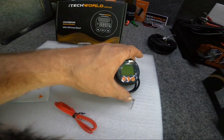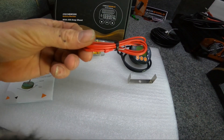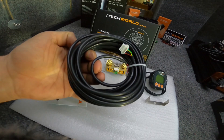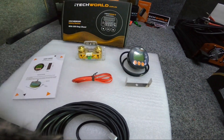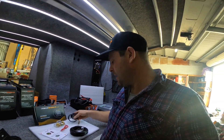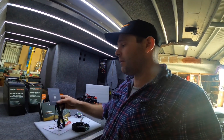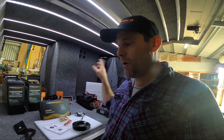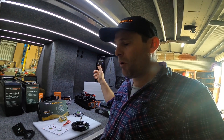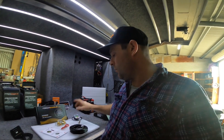We've opened up the box — it's got the user guide, the smart shunt, the monitor, a mounting bracket, a power cable, and a longer shielded cable to go from the shunt to the monitor. We're going to start by putting the monitor into our switchboard, and while we're there we've also got the remote switch out of the inverter, so we can put the switchboard back in and not have to pull it out again for the inverter install.